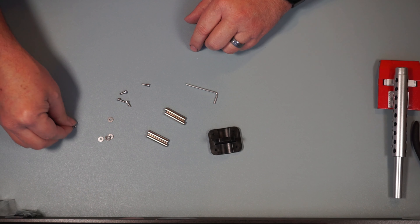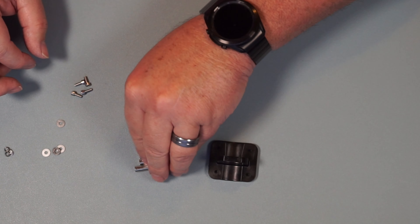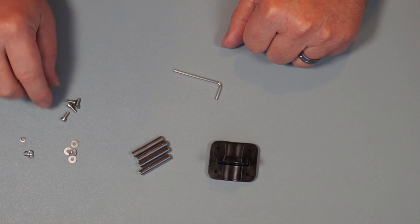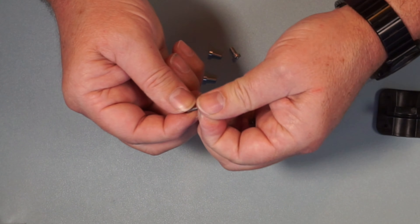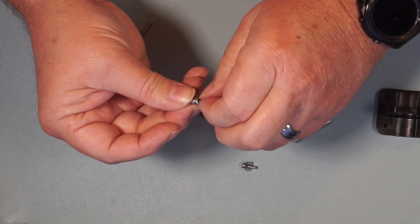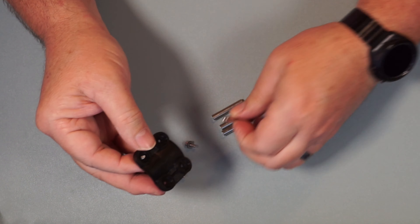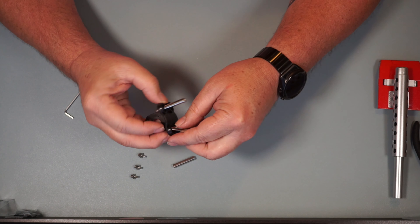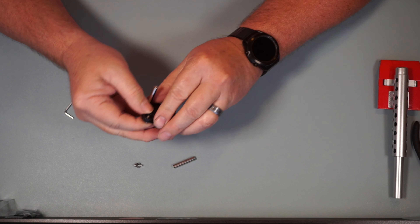Some of these little washer packs aren't labeled, so you've got to be careful to get the right one. We have TR218, four TR248s, the TR250 washers, TR249 lock washers, and PM3 by 8 allen wrench screws — so make sure you have an allen wrench. We're going to put the washers onto each of these screws: the lock washer goes on first, then the regular washer. Then screw these in — they're threaded. Tighten them down hand tight first, then fasten each screw quite tight.